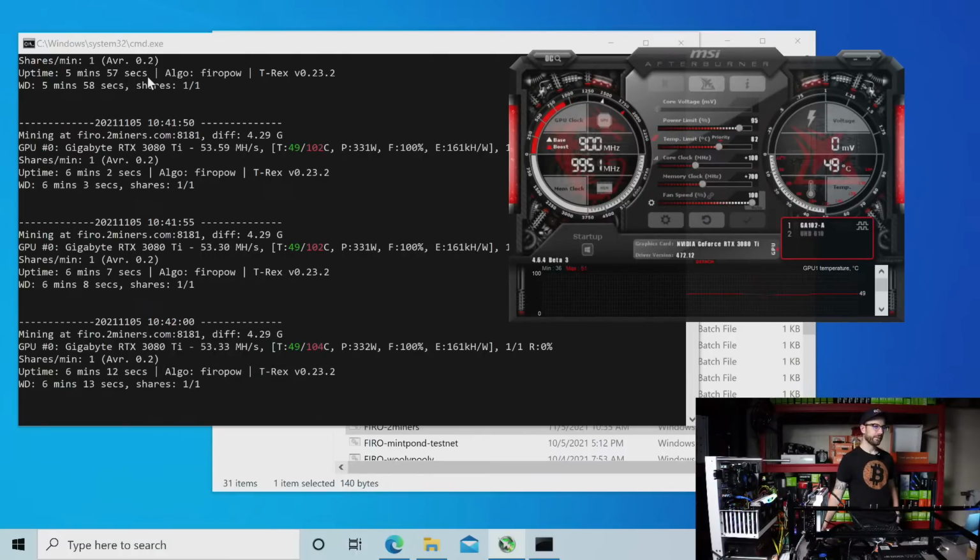Tandyman, it seems odd, but you get the best performance on a 100% power limit, plus 150 core, and 0 memory. That's crazy. What card do you have? What 3080 Ti do you have? Juan Carlos says 0 core plus 400 memory, 65. I think 65% power is too low for this one, if you're talking about a 3080 Ti.